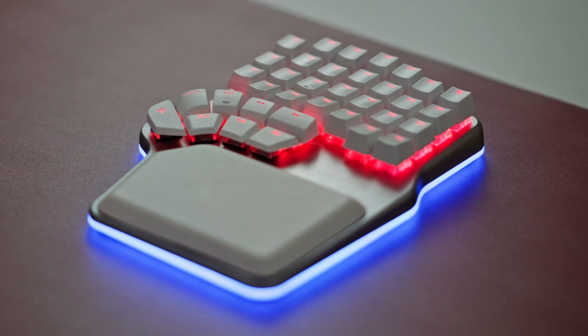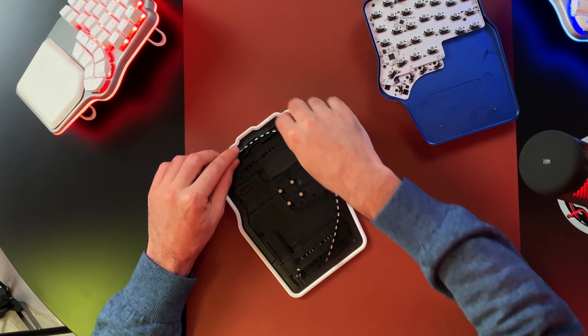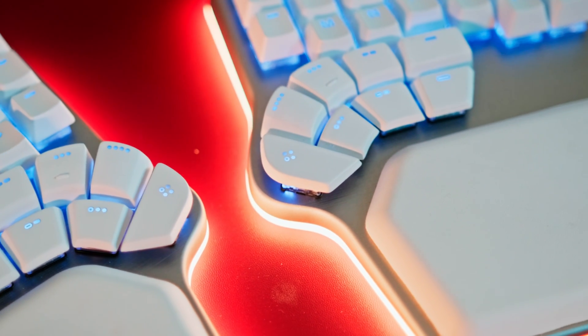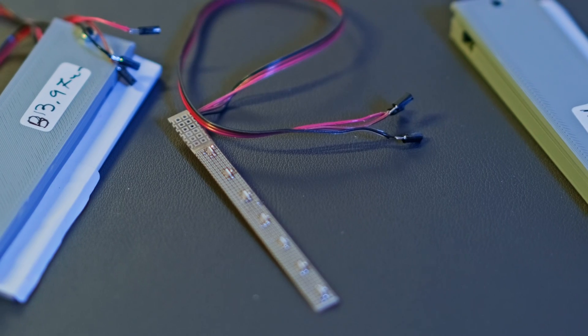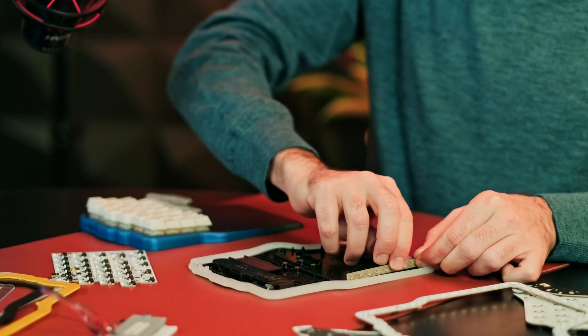Finally, we wanted the underglow to be an optional extra, so it should be independent from the backlight of the keys. The first concept was based on a flexible LED strip placed around the perimeter — it gave even light for all the diffuser and was thin enough to leave room for the tenting legs. But there was a massive problem: around the corners and near the thumb keys where the keyboard narrows, there wasn't enough space. With the first option gone, we considered what we call the PCB islands — a series of small PCBs with LED clusters strategically placed around the perimeter between the tenting leg holes, using diffusers to distribute the light evenly. However, this solution required a lot of connections between the different PCBs, which affects the price and makes it more difficult to assemble.